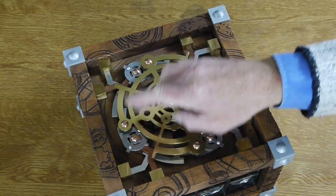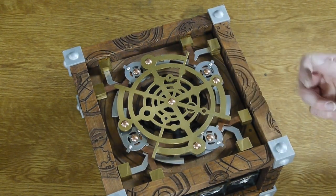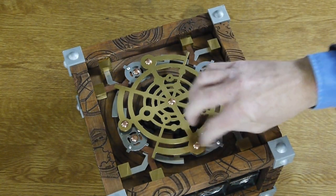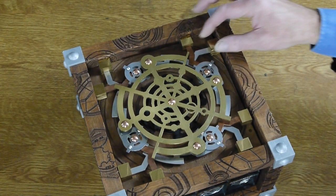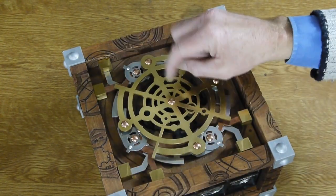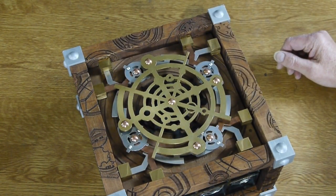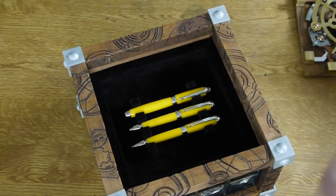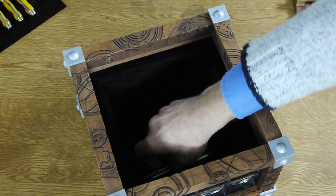The copper head ones have actually got threads; I've put a hole at a particular height. I cut them off at a particular height. There's spacers on the mechanism, and I tap that hole, and then I put bolts in there, or machine screws, and so everything is metal apart from that acrylic there, and the baseboard is actually wood. So take that off, take the pens out, put those somewhere else, and take out some refills I've got in there.